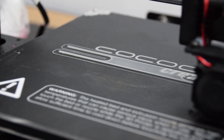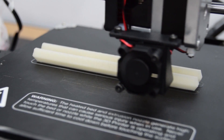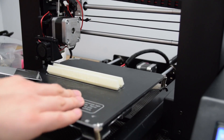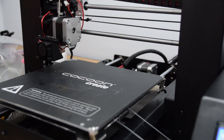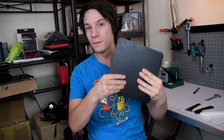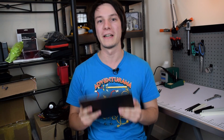For the PLA print, as you'd expect it went down fine onto the BuildTak-like surface. I printed it with 60 degrees bed temperature and it had no issues sticking down — there's a tiny bit of warping but you'd be hard pressed to notice it. Getting it off the print bed is quite difficult though, because these adhesive surfaces stick down and you can't remove the bed on the Wanhao, so you have to scrape at it, which means your bed goes out of level. This is the first comparison point with the Zebra Plate: it's removable.